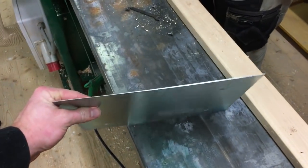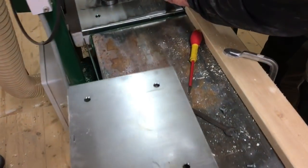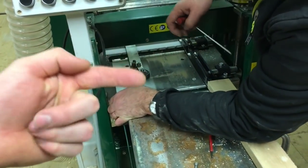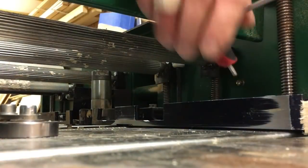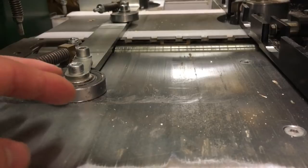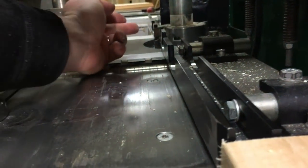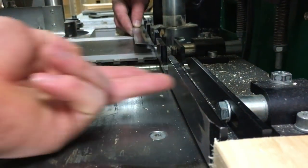Here you can see one of those sheets that's 1 millimeter thick, and my dad just took it out. And now basically when the piece is coming in here, it's not gonna be so high, it's gonna be lower, and the undercutter will take away more. So you see, when you adjust the width, this here is what gives pressure against the board and pushes it against here, because later right there is the side cutter, and so it needs to be against here.